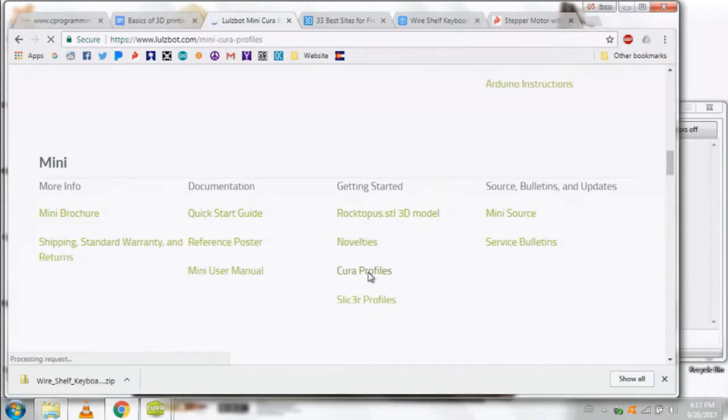So that's only one part of the whole idea to thing tool chain. If you go from your inception of your idea, you want to have a way to capture that. And the drawing softwares that I just mentioned, I frequently use SolidWorks here. That's what I license. I found myself working a lot with Fusion 360 lately. FreeCAD is a nice open source and no cost full-featured CAD program. And then there's things like Blender and SketchUp that are also available to use for free. And then once you port your model to an STL, you load it into Cura, and it drops it right into an instruction that the printer will understand.